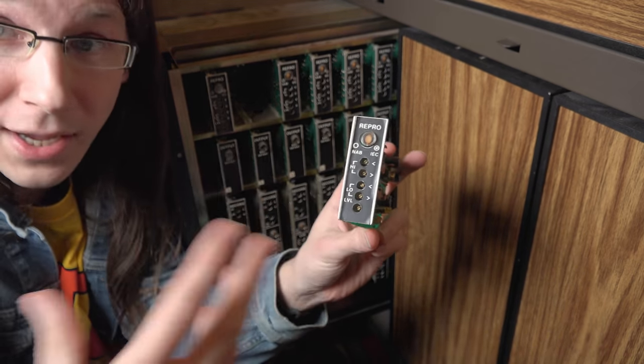That's eight channels per drawer, and there are three drawers — so imagine the work required to calibrate this machine. In big studios back in the day, they aligned the machine almost daily. Technicians visiting from other countries brought their own calibration tapes so the machine could be calibrated to their standard and play back the same way as on their own machine. This machine also needs maintenance: the power supply needs servicing every ~10 years, and the fans need replacing.